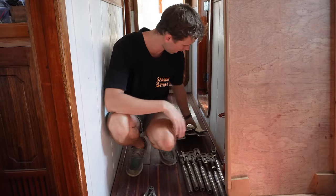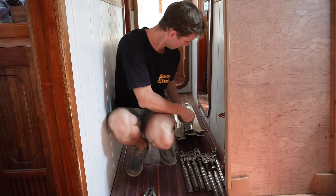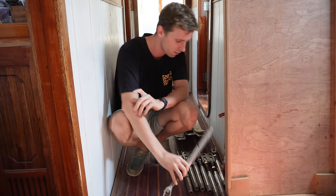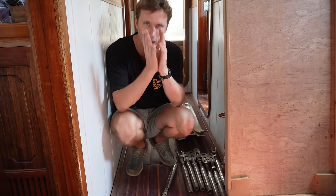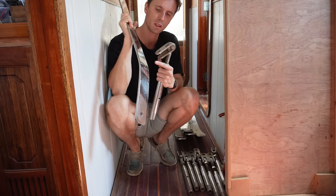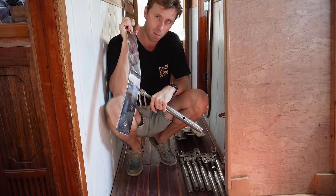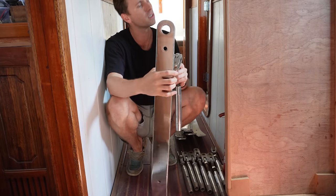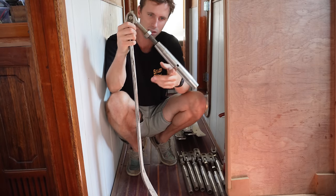Down here in the boat, I have managed to get together eight chain plates and eight tensioners. So these were all here before. All the tensioners are the same. The chain plates, however, aren't. They're just a little angle difference in all of them. So very simply, the bottom screws fasten onto the cover board and the top plank. This small one fastens onto the rail. There's a pin that goes through here, and that fastens onto the stay.